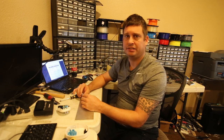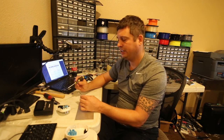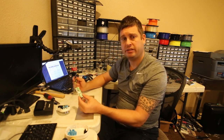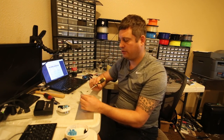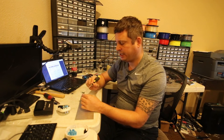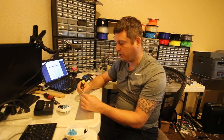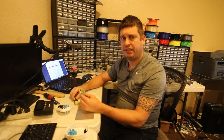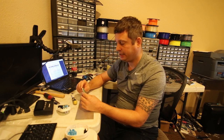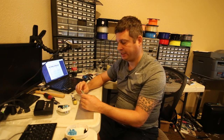I would not buy this for an Internet of Things device in your house — it's junk. The app is buggy, the English is very poor, there is no help for it, and their support will just send you some broken English instructions. There are a whole bunch of electrically conductive points on this board which I suspect are for in-system programming — I just don't know which ones are what. This chip is rated for Ethernet, so very likely some combination of these points is an Ethernet jack for connecting to and reprogramming the device.